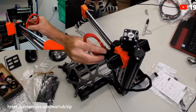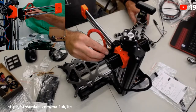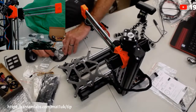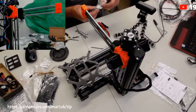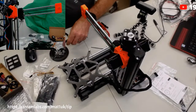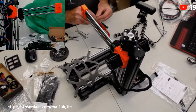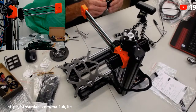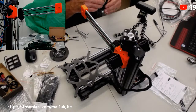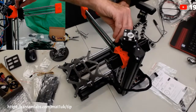That's going to go on there like that. Which is quite good. So we'll see what we need to attach that with. Use the other hand to secure heatsink with the upper M3x20. Insert and tighten the screw into the lower hole. So M3x20. Little itty bitty ones. M3x20 is those, because I can measure those up against that and go, yes. So we do the... right, okay, yeah. So they go in from that side.